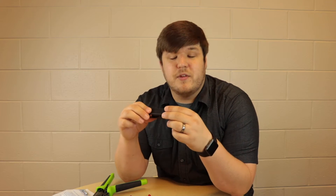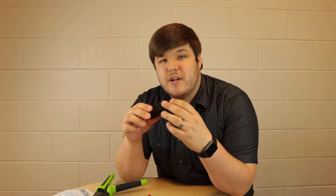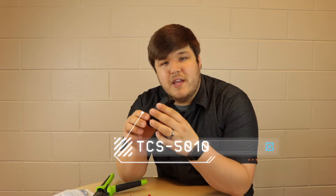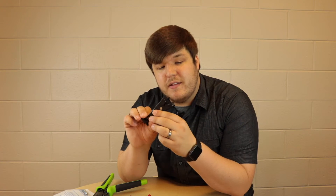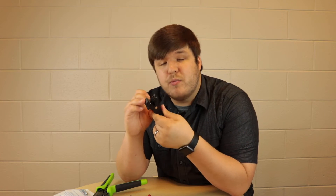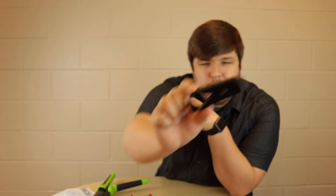I've also been trying to find the best coax stripper that meets a price point — I'm not a professional installing these every single day, and I don't need something that can withstand thousands of terminations. What I've got here is a TCS-5010. It's already got the blades in there at the appropriate stepped levels. You can't take out the cartridge — it will not come out. There are aluminum rollers that hold your cable as you spin it, and it's a very simple pinch-click operation.